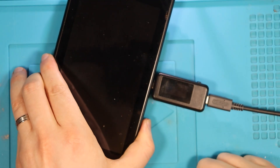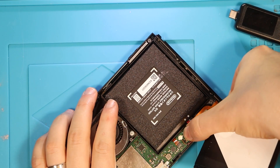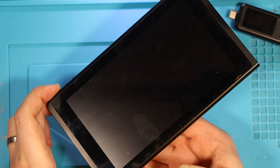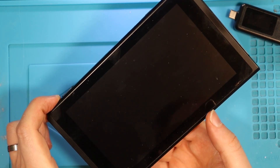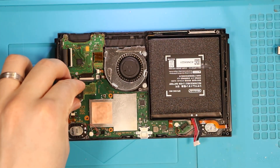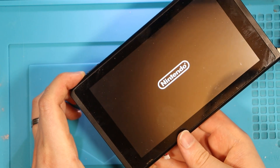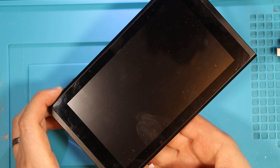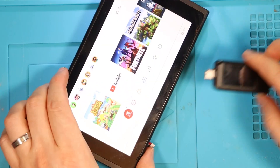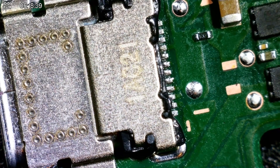Let's turn it over — nothing. I'm going to try a different battery just to make sure. Does it turn on if I put in a charged battery? I kind of feel a little bit happy about that. But this battery actually has charge and it's not turning on. Oh, it would help if I had the NAND in, wouldn't it? Silly me. Now, if I put that battery back in, is it going to turn on? Yes, it is. So there is definitely something wrong with the charging port. We tried, I failed. What's nice is that there's no parental controls on the switch at least.